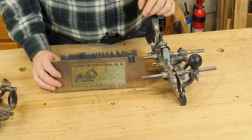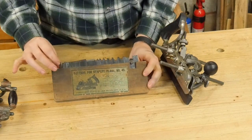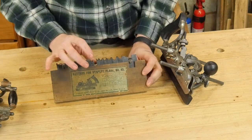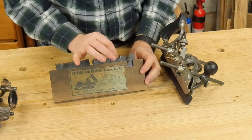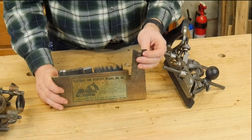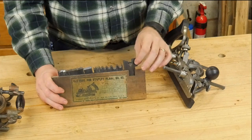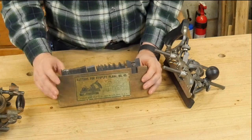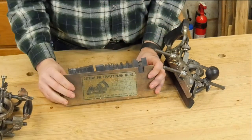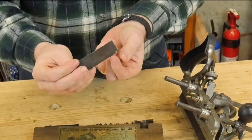Basically, this is designed to replace a lot of your old wooden planes. We have a bunch of straight cutters all the way from an eighth inch up to one inch. Then we have beads from an eighth inch up to, I believe, a half inch. And then we have a sash iron that will actually make window sash, which is a really cool feature. You can also get a lot of other cutters, and any of the cutters for the Stanley 55 will fit the 45 — at least the newer model 45s that have this little notch you can see in the blade.